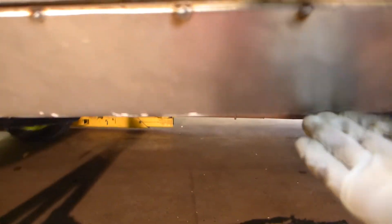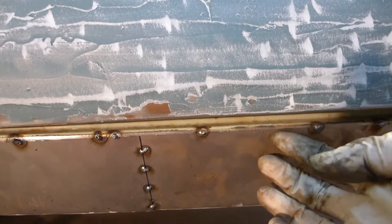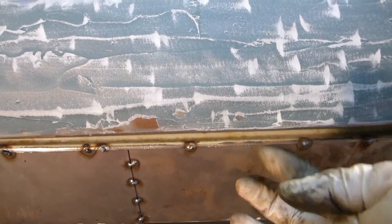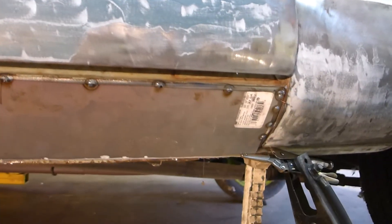The edges are pretty good but the center is pretty flat, and the bottom isn't attached to the car yet. I actually overlapped the new metal a few inches in the center. When I cut this, I left a little lip so I could slip the new metal behind it and give myself something to weld to — a good reference point. There is our new rocker.